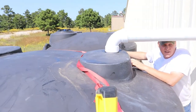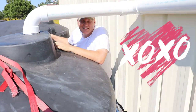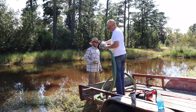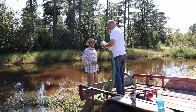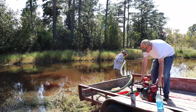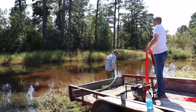Rule of thumb: don't sit on the tank if you're a little chubby — you don't get on the tank. All right, we made it down to the lake. We're getting everything set up with the pump to suck out some water and fill up these blue barrels to go over and fill up our big water tank. I'm putting on the screen to help filter out the junk from the lake. We're also going to need to prime up the pump and get that set and ready to go up the red tube into the blue barrels.